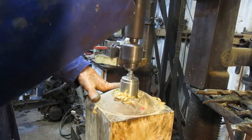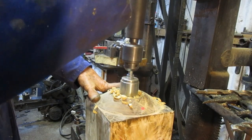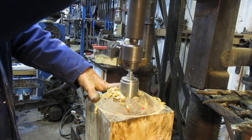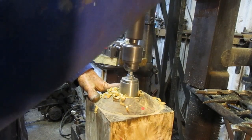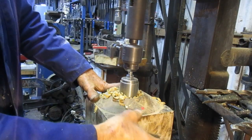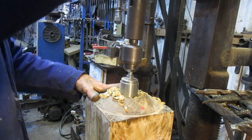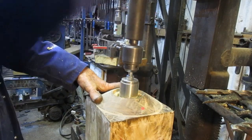Once I've done this, I must do the same on the round neck bearing of La Cotte's watermill, where that completely shrunk onto the shaft, and that's a 40 millimeter shaft. But there I've got to put the bush in the bottom because there's a lot of wear on the actual stone spindle up towards the top. So if the bush is down here, it'll be on the original diameter, which is 40 millimeters, so I can't use this tool again, unfortunately. The wood is ironwood.